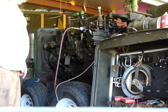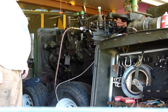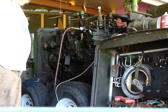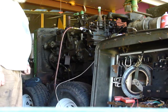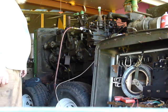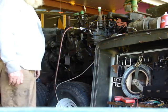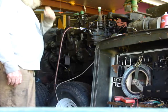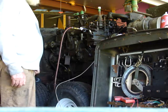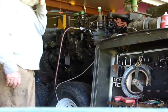One major thing is I got the pony motor to fire today. It wasn't locked up, but it had a stuck exhaust valve, and I was able to unstick it through the spark plug hole. The other side's okay. If it fires off, I don't have to drain the coolant or pull the heads and mess with the valves with the heads off. Plus the mag seems to be okay if it fires, so I don't have to tear into the mag.